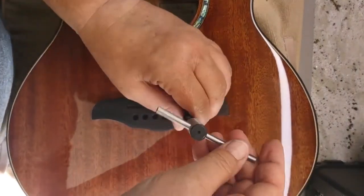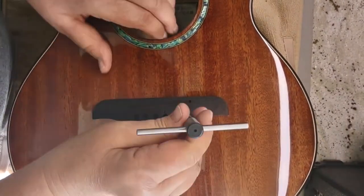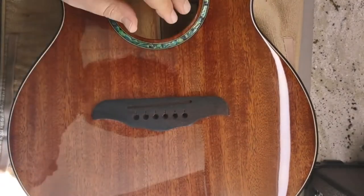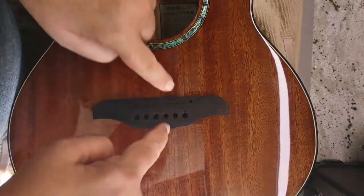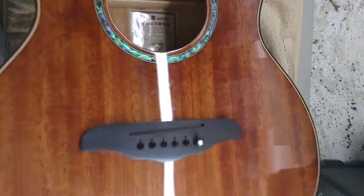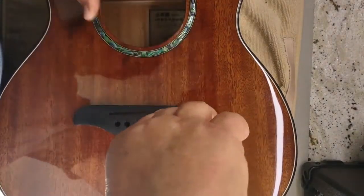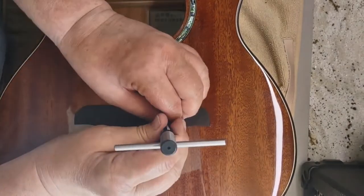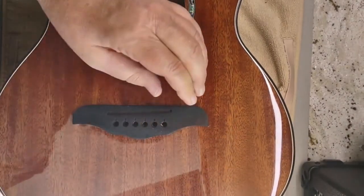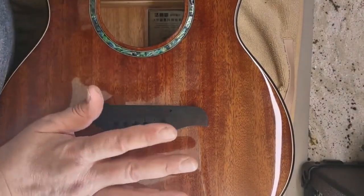Put this back in, start here — one half, one full. When you pull it out, you want to pull it straight up, not at an angle, because you want to keep the proper taper. We're getting close — so maybe four. I just tap to get this in; you don't want to jam it. So put this out again, we'll do our fourth turn — half, one.